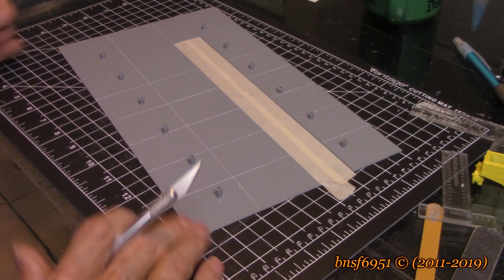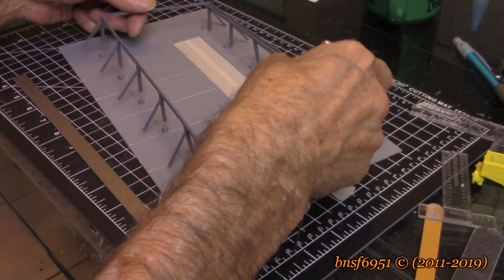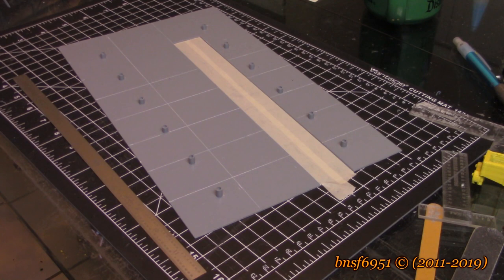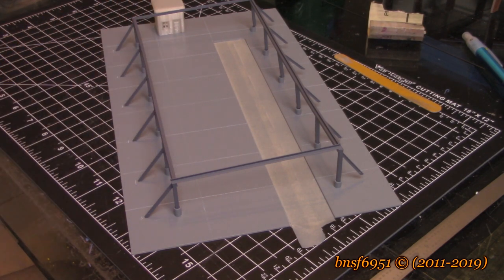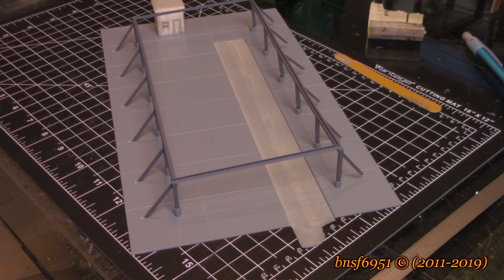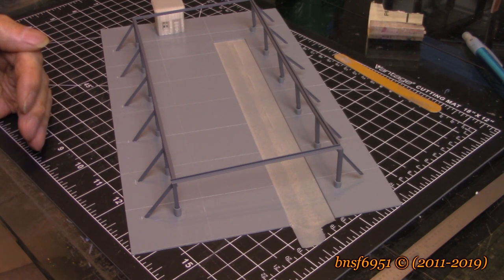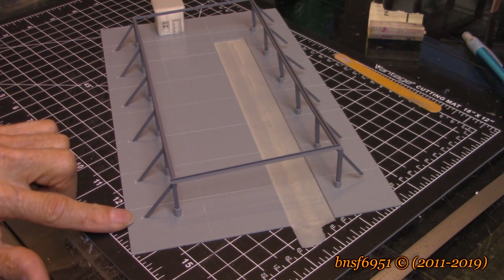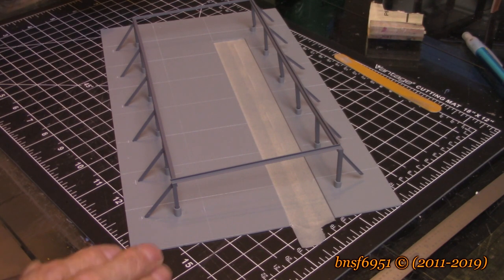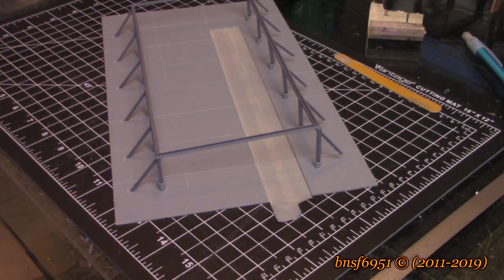I'll take the crane structure and put it in its space like it's supposed to be, and then we'll see how we go from there. As I test it all out, I came to a realization — these stanchions right here are going to protrude past the building, making it very easy for trucks to back into them. So I put little tick marks and I am going to put bollards in place so trucks can back up without crashing into the structure itself.